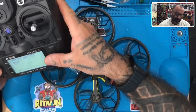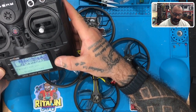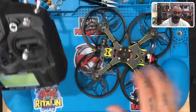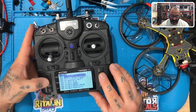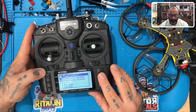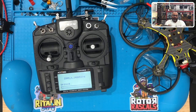Let me switch to my XM series - select RXSR, there we go. Now I have the T-Light - the T8 Pro will essentially have the same Open TX firmware. What I'm going to do is drop the firmware on this radio to match yours. I'm going to go to my firmware folder, TX firmware, and change it to version 1.1.3 - that's the older firmware which is what your radio runs. I'll flash the internal module with that, then pick FrSky X protocol and go down to X2.